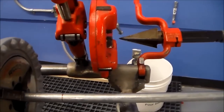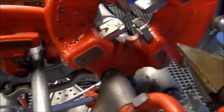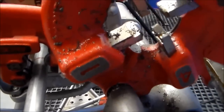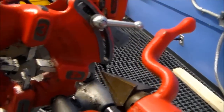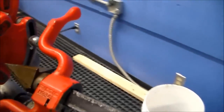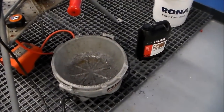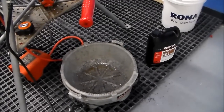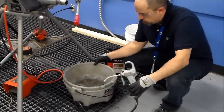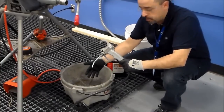This here is your cutting tool for cutting the pipe — you're going to back this off so that it goes over the pipe. This is your threading tool. And this is your reaming tool. Down below is your bucket that has oil in it, which you are required to put on the thread as it's threading to keep it from burning out the threads on the dies. The filings and the oil will drip into this bucket.